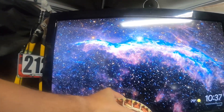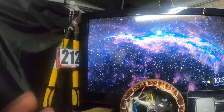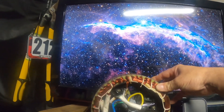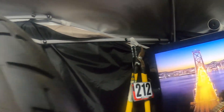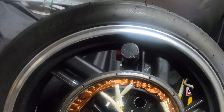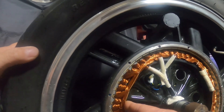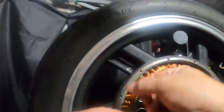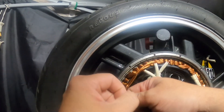I used to think that a 5-turn motor had actually five turns of wire around it — that's not completely true. It all depends on how many strands of wire are in there, and that depends on the turn ratio. A lower turn motor, like a 2T, can have a lot more strands of wire. This is raw copper wire that has a plastic coating on it, with a whole bunch of single strands together making that bundle of wires that wraps around those iron plates to create your turns.